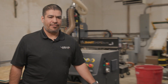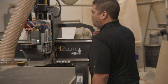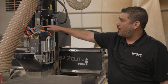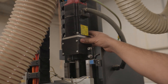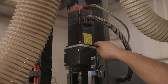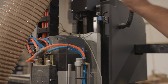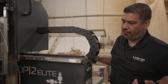Let's go over the frame. The machine comes standard with a 12-horsepower HSD spindle. Up top you'll see the big FANUC motor — it's a 750-watt motor, all matched as mentioned. You've got your encoder cable, big 25-millimeter linear bearings, and a 30-millimeter ball screw.